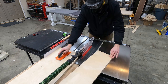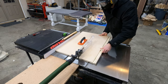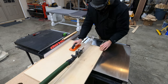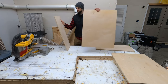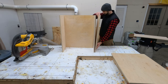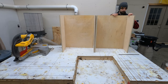One really important aspect of breaking down all these pieces is to make sure that the fence stays in one place throughout the cut. Whenever you move the fence to make another cut you don't want to have to move it back to that original space, so make all the cuts in one spot first then adjust the fence as necessary. I'm making two cabinets, so you can see I first ripped everything to the same height, then adjusted the fence inward and cross cut them to the different widths.